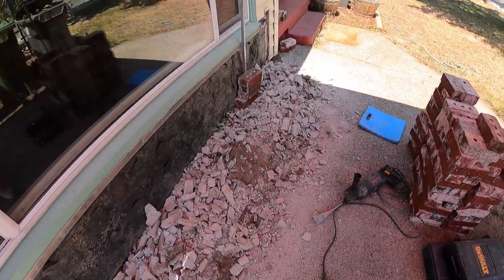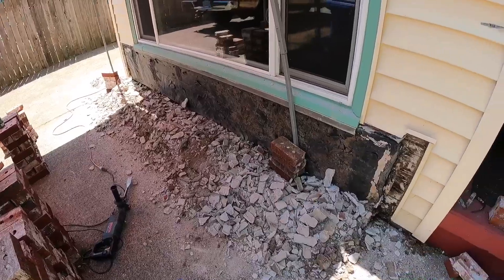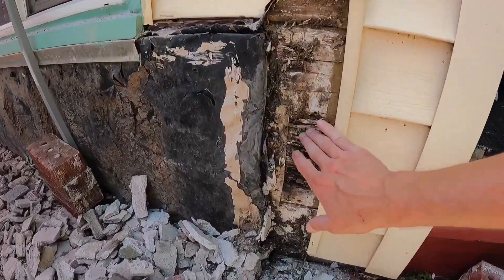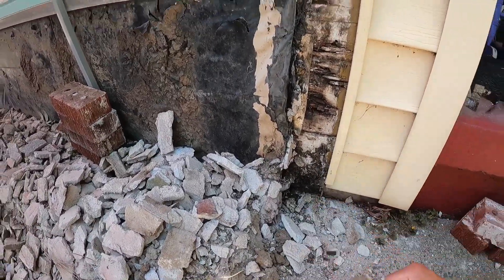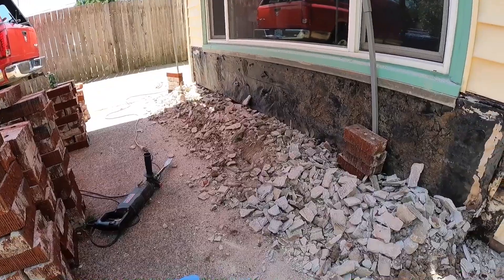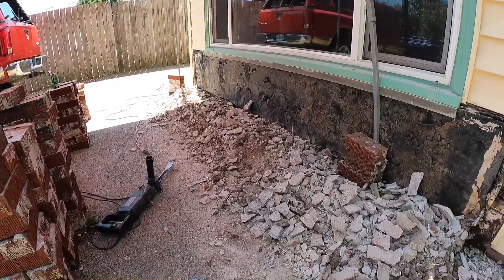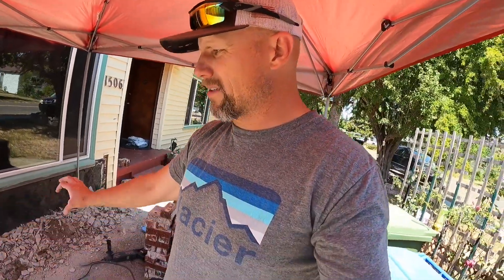It's actually, there's no concrete underneath. So tomorrow I'm going to pour back this section of concrete here. You can see the wood's getting all nasty — that's the old siding and whatnot, that's what's underneath the vinyl. That's what I'm faced with. Move all this, get it out of the way, then pour the concrete, do waterproofing, and then I'll end up putting another facade of this brick back on. That's what I'm doing — life of a carpenter, you've got to love it.